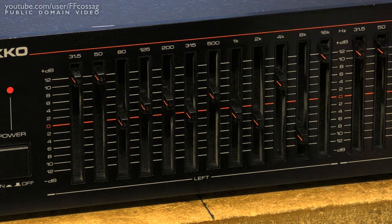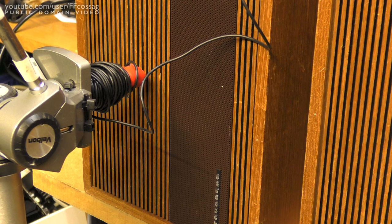I'm really curious about the low end because these speakers sound very clean to my ears, even if I just gain up the low end way out of the natural frequency range. I'm thinking we're going to see some pretty decent results. I'm going to place THD at 30Hz at less than 15%. Here's our testing setup for the THD tests — super duper near-field, right up against the centre of the woofer — because we're going to get huge room distortion otherwise, so we have to do this at a rather low level. The equalizer is disabled, so let's get to it.